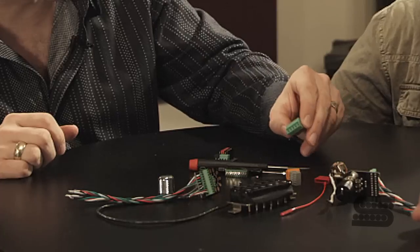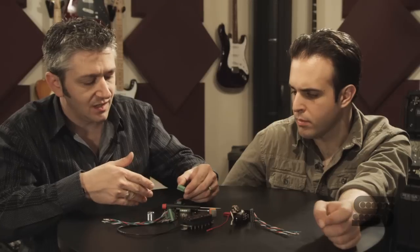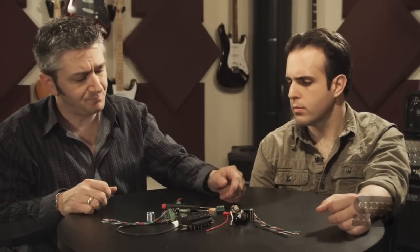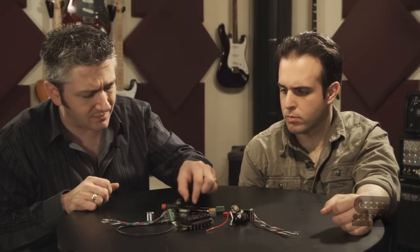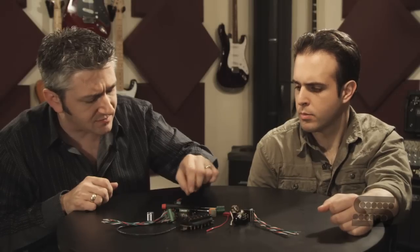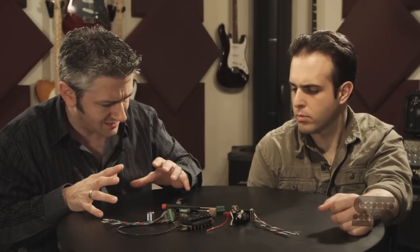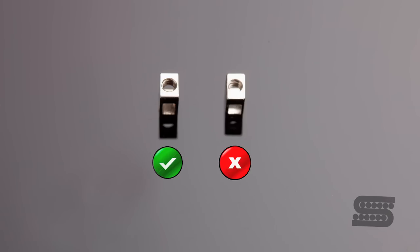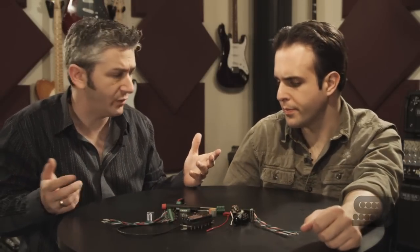Here's one that's bigger — kind of oversized. You try to line up ten of these in an electric guitar control cavity, it's just not going to fit. And you saw we put it in a real thin, slim-bodied guitar and everything fit just fine. But then some people started sending us other connectors — less expensive options. We took them apart and the screws were more roughly machined, the tolerances weren't as tight, and the block was shorter, so you end up with fewer threads in each block, which translates to the ability to wear out over time.